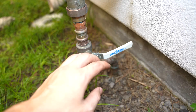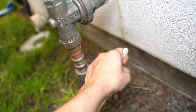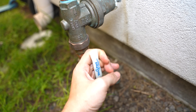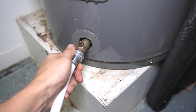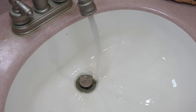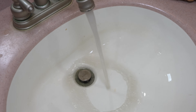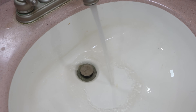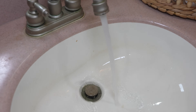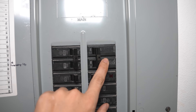Here's a quick tip of the trade: when you're opening up any kind of valve, be it water or gas, you always want to open it up nice and slow. Don't forget to close your drain valve. And remember that faucet we left open? When your water heater is completely filled back up, you're going to see water come out of that. Don't be surprised if it comes out in spurts, and if the water is dirty for the first minute or so — bubbles and different spitting noises are completely normal until all of the air inside of the pipes is pushed out. After we verify that the water heater is filled back up because water started pouring out of the faucet, we can go ahead and turn the power back on.